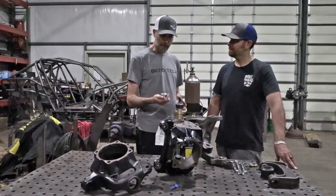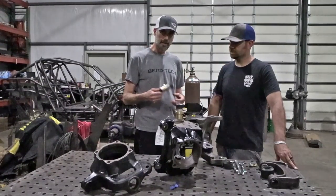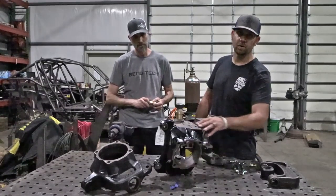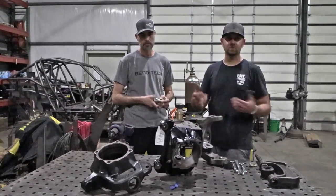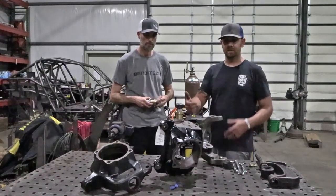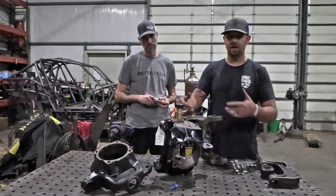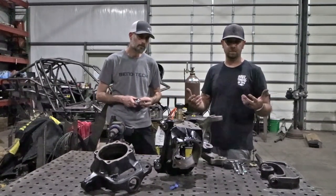Be careful when welding before you assemble it to the vehicle — do a test fit and make sure the bolt goes in good. You can use anti-seize or grease during the weld process to help protect the threads, but clean that up and install with red Loctite when you're done. Since this is a cast material, preheat the knuckle to ensure a slow cool rate, which keeps cracks from forming. I like to do a small root pass first, then come back with a cap pass over the top. The root pass heats up the assembly and distributes heat, so when you do the cap pass you're not hitting it with a ton of heat all at once, and it won't crack as easily.